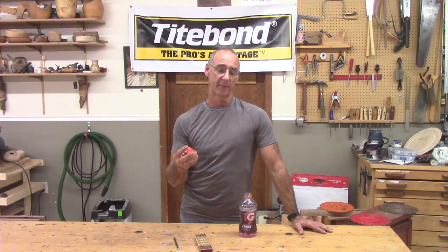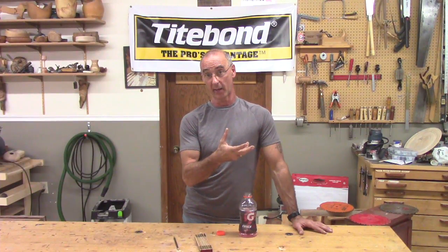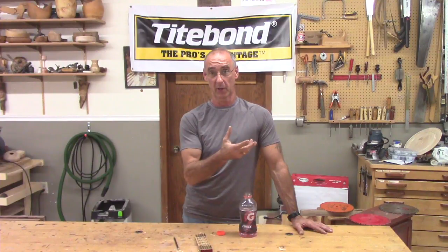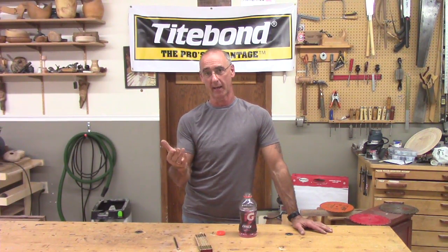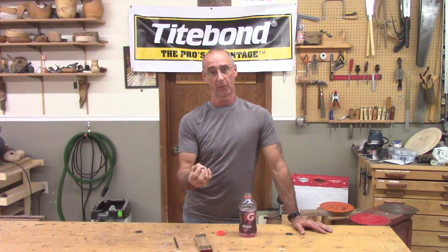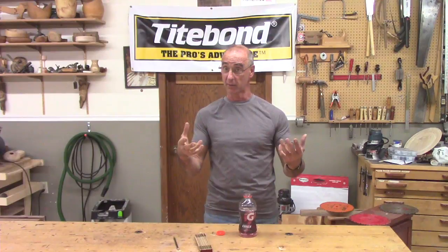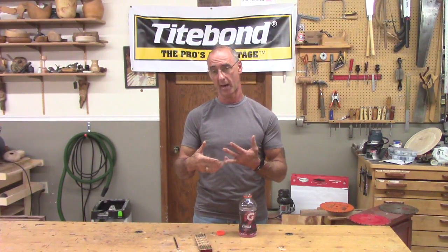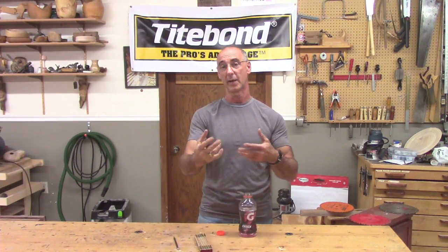Because the thing is, too, you're doing this because it got wet. Now you're talking about putting a water-based paint on there. So anytime you paint a piece of pine with water-based paint, it raises the grain because the water from the paint gets into the wood and it affects the wood. If you seal it first with primer or seal coat, then the water never has a chance to get to the wood and you don't get that grain raising.